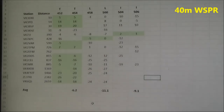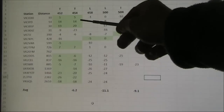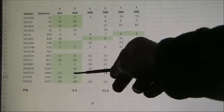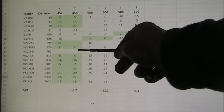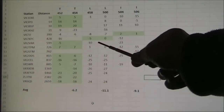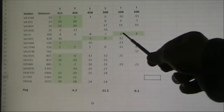These are the WSPR results with the three antenna configurations tested. Firstly on 40 metres, in almost all cases the T configuration — i.e. the 5 metre long vertical with the full 10 metres of wire included as top loading — provided the best results. That was particularly the case for short distances (groundwave coverage) and longer distances of 800 kilometres or more. However, there were some in-between cases where either the inverted L or just the 5 metre long vertical were superior.